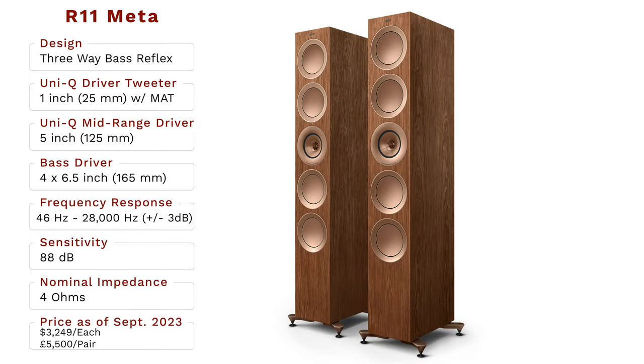Now let's talk about the 1723S. As you can see, these are both monitor speakers with 6.5-inch drivers. They're both 4 ohms and 88 dB efficient. But the 1723S is a two-way speaker, which means these woofers actually handle both the mid-range and the bass. It's also ported. There are two ports on the back versus the sealed design of the R6. And I was actually a bit surprised because they are very similar in their sound characteristics overall. But I did find that the R6, again, has more nuance and more detail than the Arendal Sound 1723S when listening to music. And I actually appreciated that. The mid-range was also just a bit more prominent and distinct compared to the 1723S, and that's basically due to the fact that you got a dedicated mid-range driver. So there is definitely some differences there when it comes down to music.